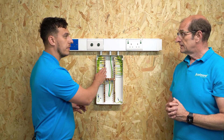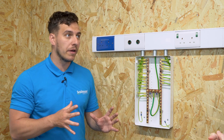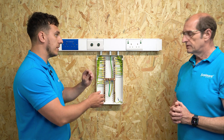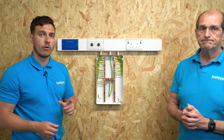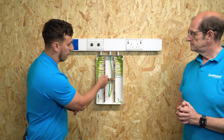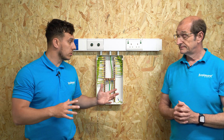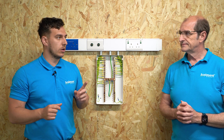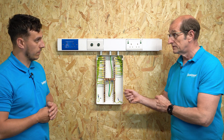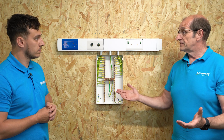There's no point doubling these up. You don't want to be thinking you can get away with an 18-way by doubling connections. On the back of the lid there's a chart that shows this is the location and what it is. Be mindful when installing these — don't think you can just double connections up. They do need their own individual numbering system. There's a requirement within BS 7671 for them to be labelled. How do you label when you've got two random circuits connected into the same place?